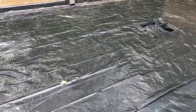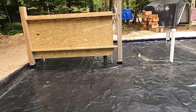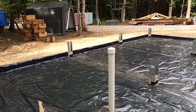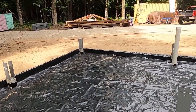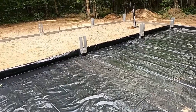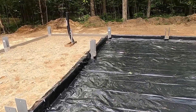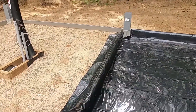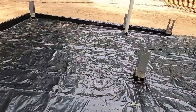As an owner builder, the vapor barrier slab thing has been very confusing. Half the information I read says you have to seal everything — you can't leave any exposed spaces because that will let moisture through. But the other half says you can have holes everywhere and it's not a big deal, that a vapor barrier is not an air barrier and that holes don't really matter. So we took the latter advice and allowed holes, gaps, or seams pretty much everywhere. I think that's okay.